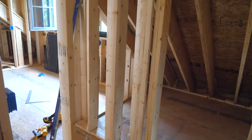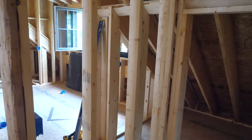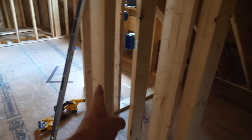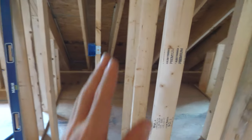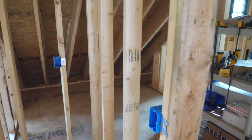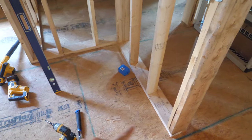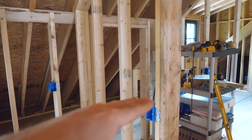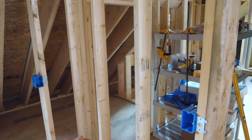I'm going to cut these two studs maybe two feet from the ground and then about five or six feet from the ground. I won't come all the way out because I've got an outlet to frame out, but I think I'll put another stud here and then another one to make sort of a window. Then I'll put the same 1x furring strips along this outside wall so we can still sheetrock on this side and on the inside too. One caveat — this is a little dry bar out here, so there's some cabinetry, and I need to leave something to screw my cabinetry to. We're also planning floating shelves above the cabinet, so I have to leave enough structure to fasten those floating shelves to.